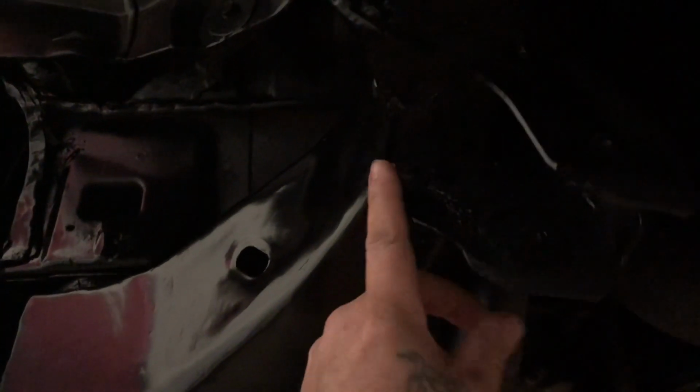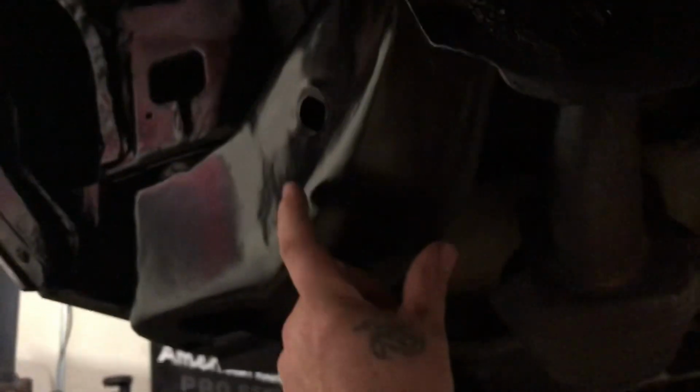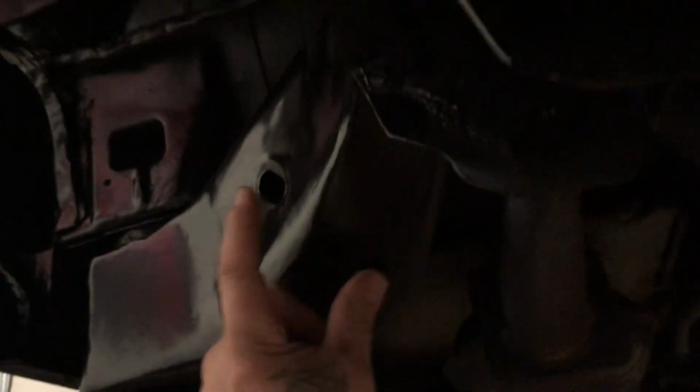But you can see, like I was saying, where the notch needs to be. You got the curve and the flatness. Some people, right when the tire turns and hits here, they only notch out the one area. You need the whole wheel to go back in there. So the back part of the wheel hits right here, so you gotta get into the mount. But now I'll make all my measurements. Normally I get this a little bit more rounded in here, but it'll be fine. So then I'll transfer all that to this side, which you can see, look how thick that is. Here, right here. But that's the frame notch. Painting this whole rail.